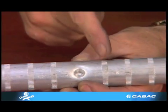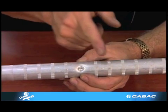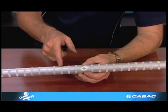All overhead sleeves are crimped from the centre outwards, ensuring both sides are crimped evenly. If this were not done, the connector would form a banana type shape and would not be suitable for service.